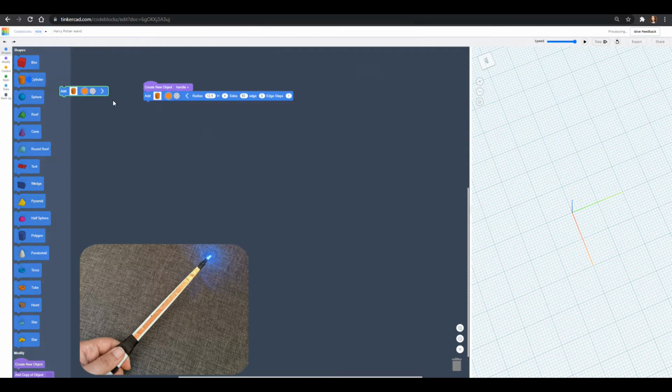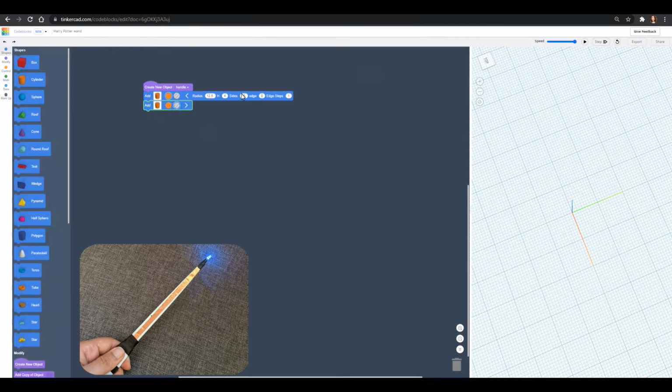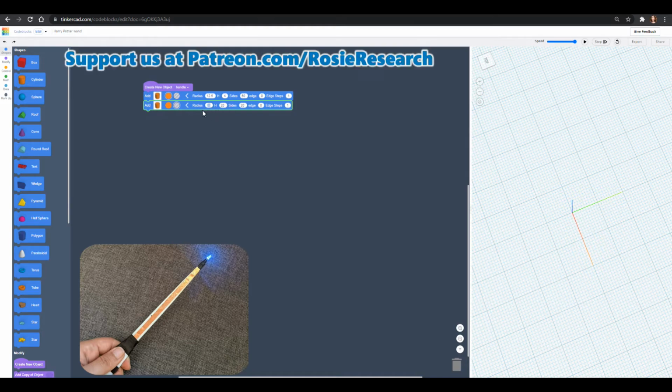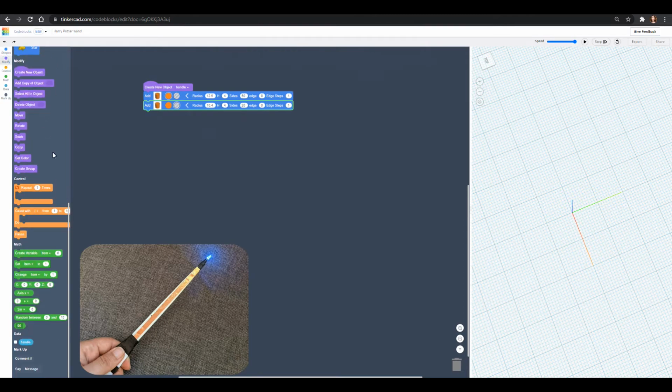And then I'm going to add a hole so I can erase part of that. This way it's just a cylinder. It's going to look like a coin. And I want to erase a hole for the coin cell battery to live in. Now, even though a radius of 10 should perfectly fit a 2032 battery, it never quite works out perfectly. So we could do like maybe 10.4 or even 10.3. Let's keep it at 10.4 though. And we'll have a height of 4 here as well. And that will cut the hole all the way through. And then we can just move it up by 1 maybe if we would like to.